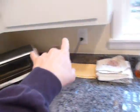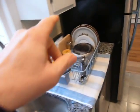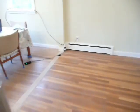Put all new GFI on their own circuit. That was never in the house. We've also added a plug and a junction box in behind the refrigerator now that ties in the old wire that went to the ad hoc wiring that you saw coming off of this wall here. You can see that there's the plug, and we've got the junction box down there.